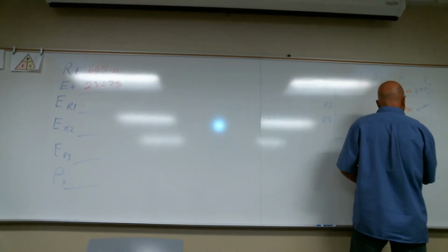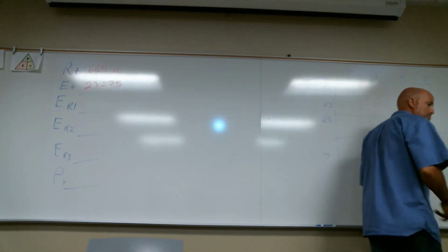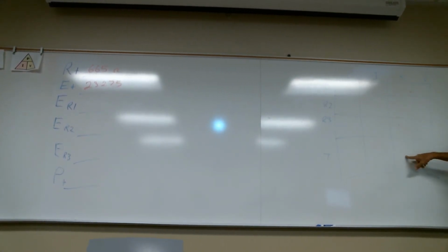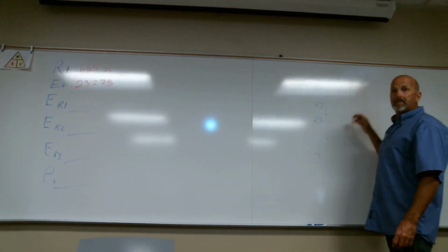Now, in that sheet I gave you on the first day, when I start entering the resistances in here, in a parallel circuit, I cannot add them down. They will not add. The voltages in a parallel circuit, if I give you one voltage, I've given you them all. It's kind of like current over here. In a parallel circuit, all the voltages are the same, and I'll show you why in a diagram if you don't remember me drawing. Isn't that why they run houses in parallel?